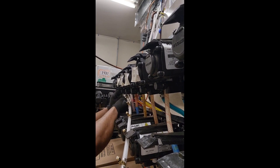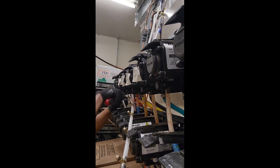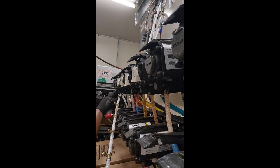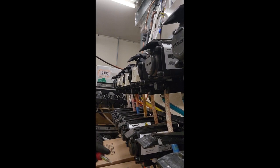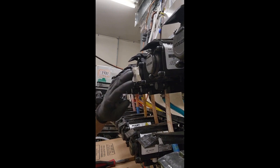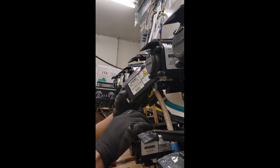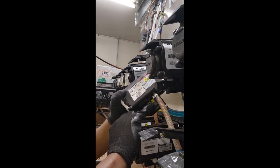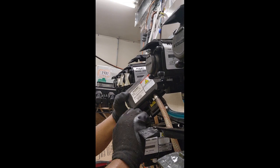I'm just disconnecting the CO2 from all of these soda Slurpee lines right now, because I'm gonna need to get into each of these just to replace the auto shutoffs on them. I'll show you why in a second. Here we go. Okay. So let's start here, and get this one pulled out, just show it to you. But you see right here, it's a little yellow sticker on the auto shutoff there. That yellow sticker says high altitude.